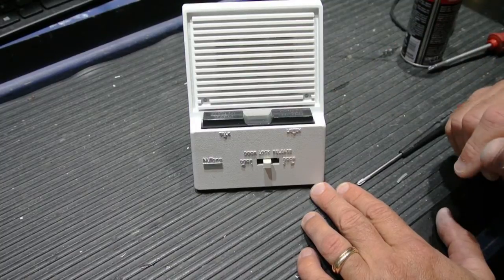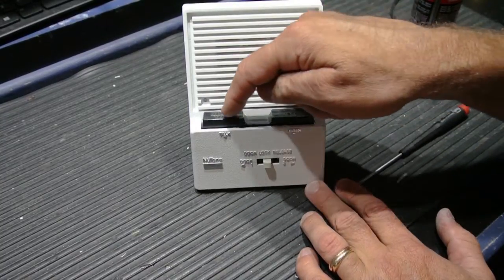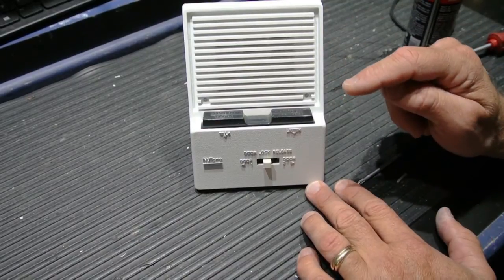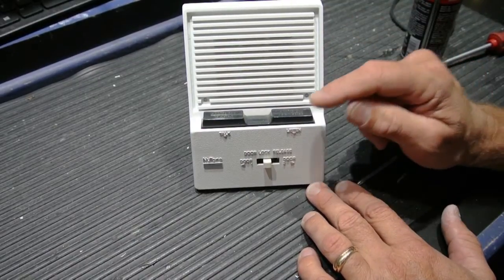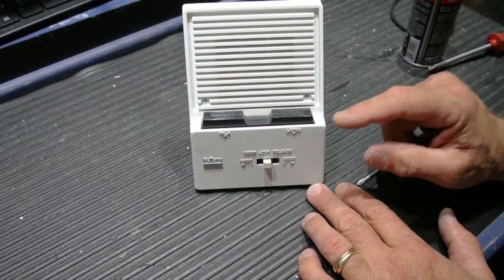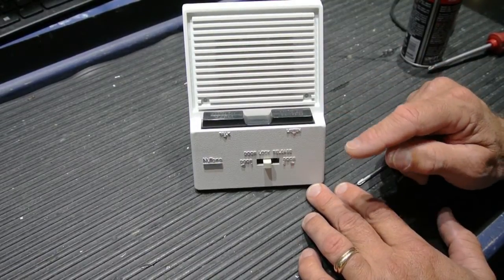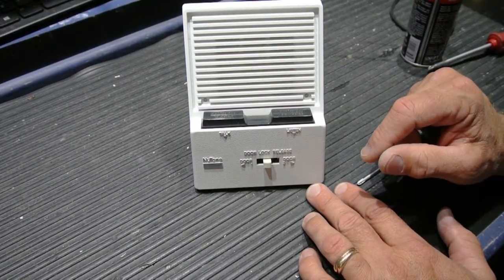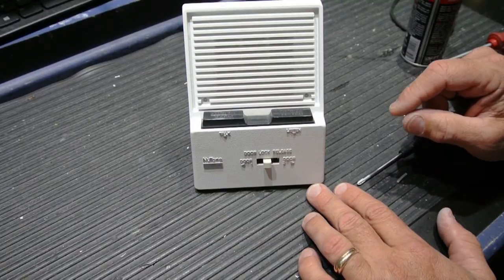So what does this have to do with service calls? When you have apartment house speakers with dirty switches, that equals more resistance, and it's unintended resistance. It's not supposed to be there. It wasn't there when the speaker was manufactured. It gradually built up in the switches over time because they get dirty. And this is what I call an additive problem.